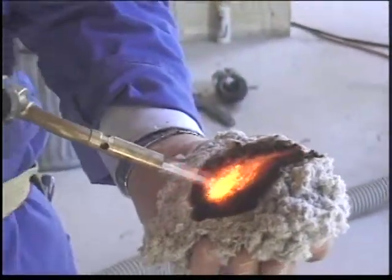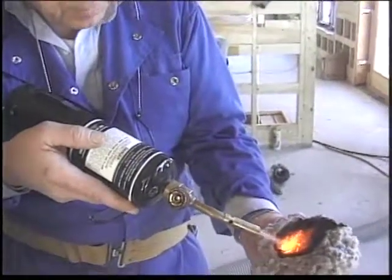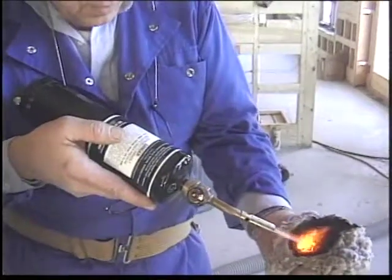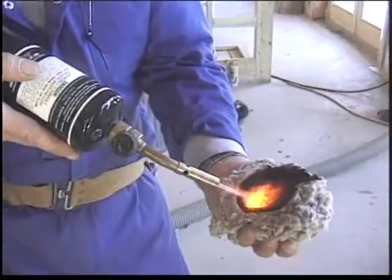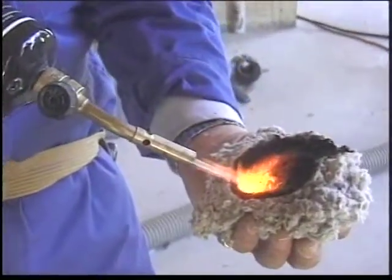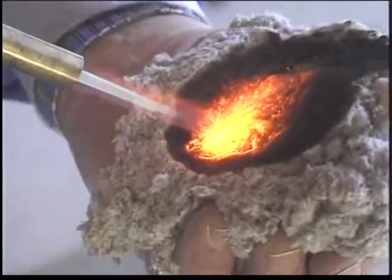Now, that is the original wood fiber, and so this starts out as a tree, and from a tree it becomes your Sunday newspaper, the soft sheet paper. We don't use the glossy paper. And then in the first stage mill, it's impregnated with a liquid fire retardant, and then in the second stage mill, it's taken down, fiberized, and then treated with a dry borate chemical. So you're dealing with the 2 stages of chemical impregnation into the fiber. Well, the fiber is cellular, hence the name cellulose.